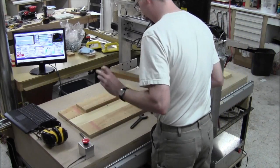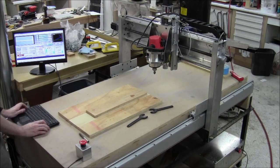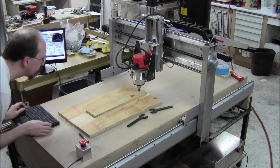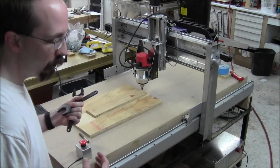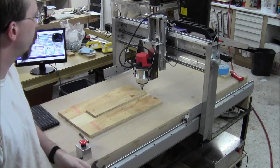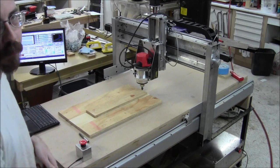The next thing I want to do is get some tape on it. I'm going to find my centering first. Now I have to figure out the next bit — I knew I was going to have to figure this out at some point. I have to get the machine to a zero point so that when the code runs, the apex on the drawing ends up right there at that center. I have this all measured, so I think I know how I can do this.